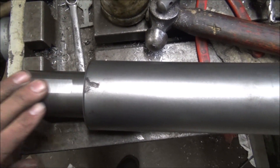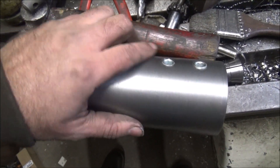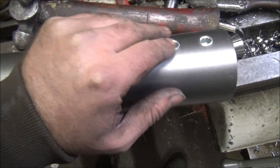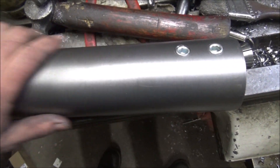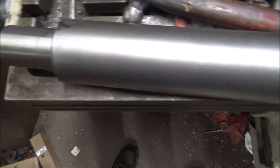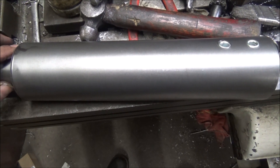Well, there it is all finished up. Got the nice flat on there and the screws are flush once they're tightened down so this doesn't stick up — that way this can go in the bore. The smallest the boring head can go is three inch and this is three inch, so this will be able to chase right behind it. So anywhere it can go, this can go. That's going to give me an extra foot of length to my boring bar. Hope you enjoyed getting to see this little snippet and you'll get to see the rest of the job later. Thanks for watching, thanks for subscribing, I'll catch you later.